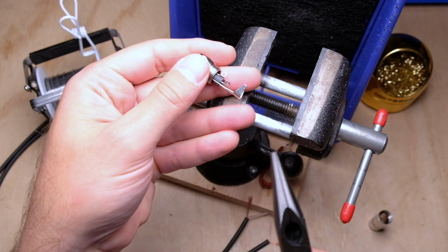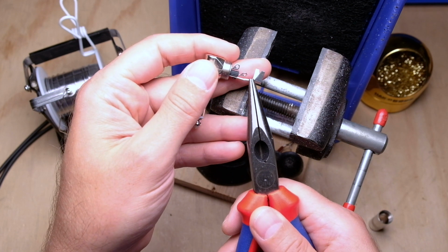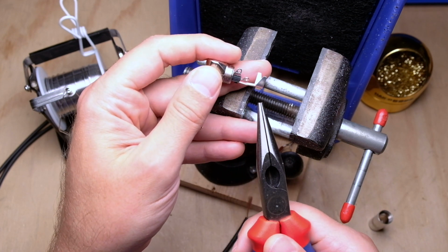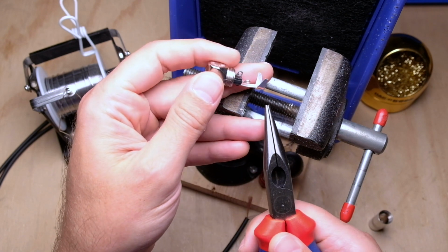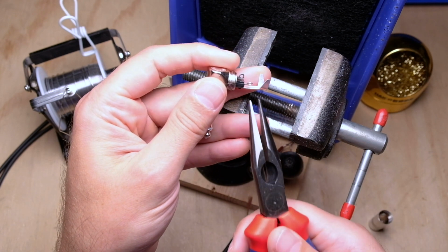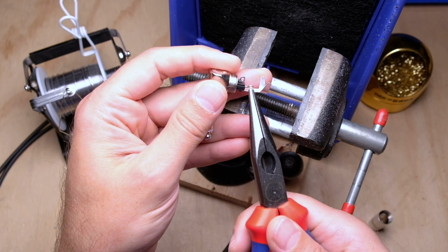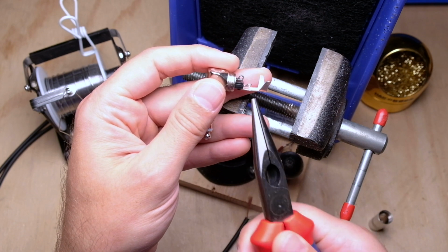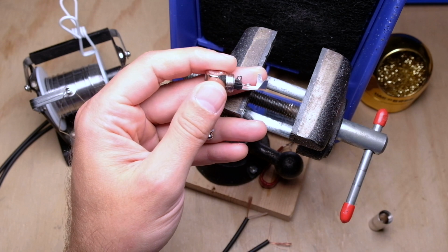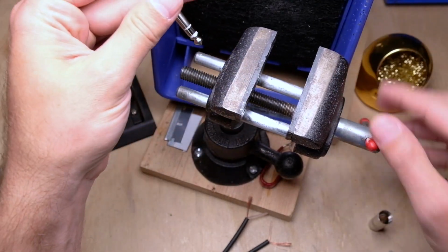And this is something I do all the time, is make very small modifications to these plugs. Don't always assume just because you take a plug out of the bag that it's exactly how it's supposed to be. I've done all kinds of things like shorten these strain relief tabs, or bend parts just a small amount, just to make sure that I have enough clearance between this and an adjacent solder tab or something like that. So if you see something just doesn't look right, don't be afraid to take some needle nose pliers to it and get it where you want it.